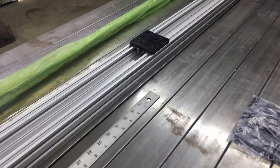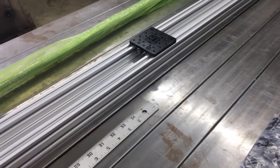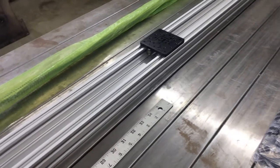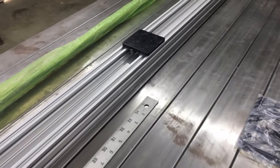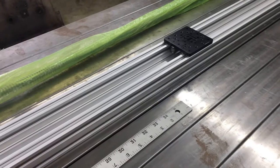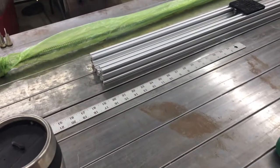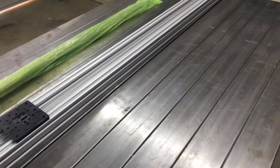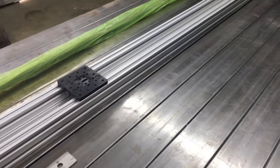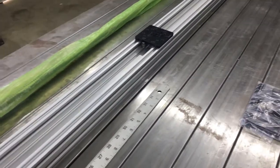This is my build of a 3D printer with a 1500 by 1500 millimeter print bed. The z-axis is not that impressive — it's only about 180 millimeters — but we can make something pretty nice with that. The idea is to use extruded aluminum, much like some other 3D printers you may have seen, but this extruded aluminum is quite beefy and should handle the printing no problem.